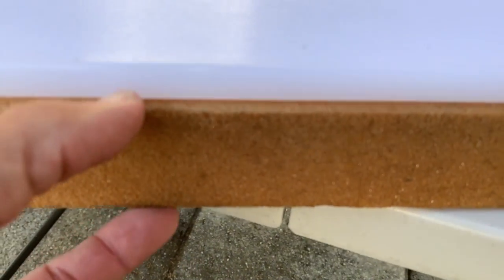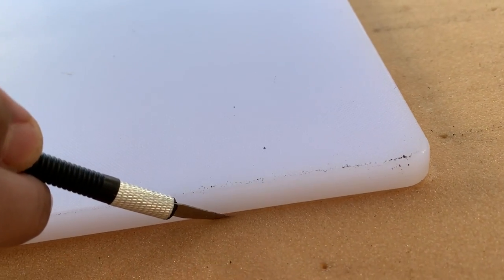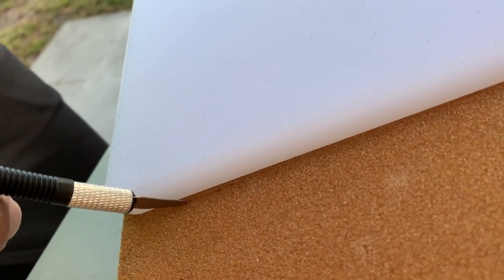our marine foam, and we're literally going to cut it the same dimensions as our fillet board. This is the thick stuff, about an inch and a half thick. We're gonna use this as the base, the flooring. We're gonna fiberglass this to our deck. Now I'm gonna use an X-Acto knife, and I'm just gonna cut the exact dimensions of this board here. And now I'm just gonna cut through, and we'll start with the walls.